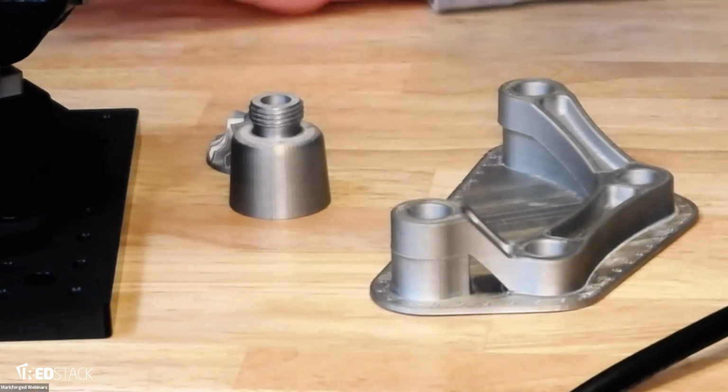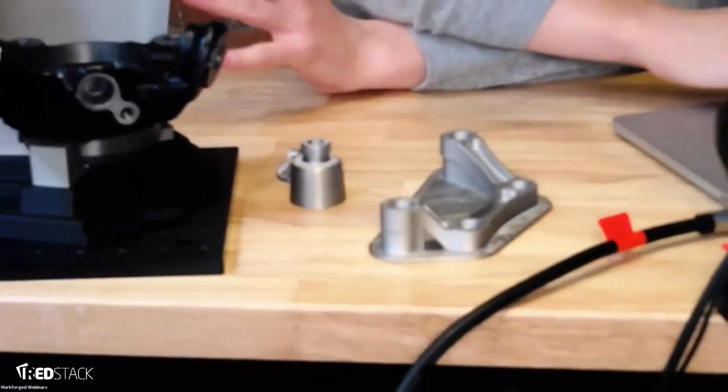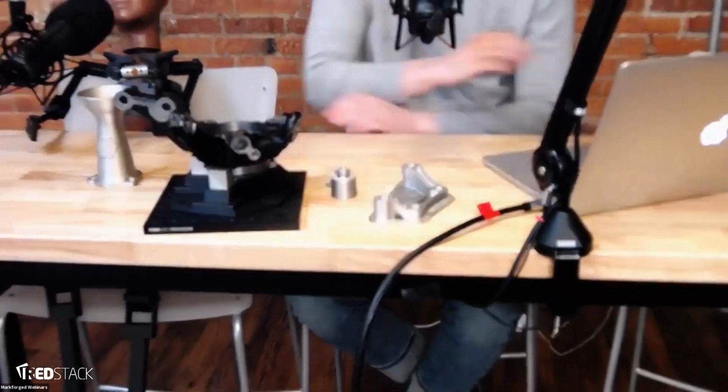What's the density of the finished part for H13? Our density is about 95%, 94.5%. But as I mentioned before, what we're doing with most parts is printing with open cell infill, so the actual density of your part is probably significantly less than that. For a very small part like an insert, it's higher. You could print with certain walls to make sure it stays strong. But the overall density is variable based on your part size. 95% if you're able to print fully dense.